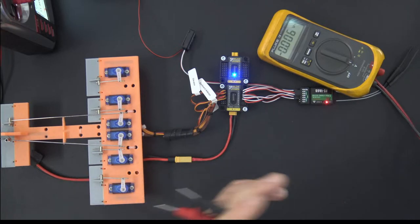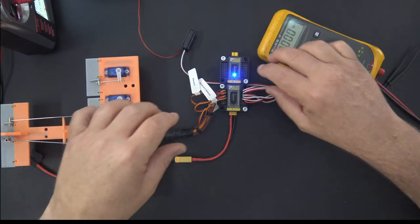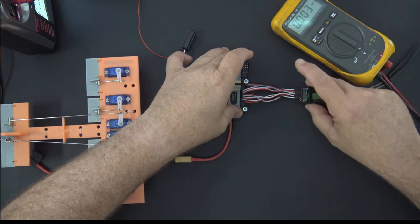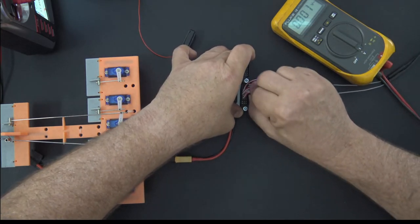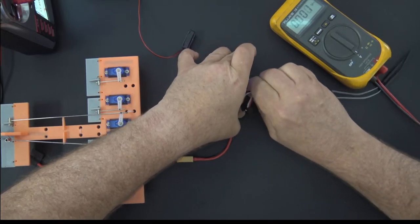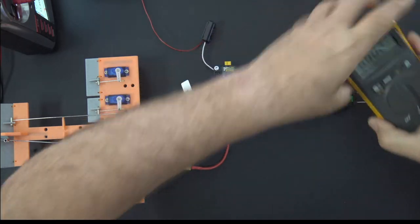23 grams. All right. So it looks like Mr. Skywriter says he'd like to see S-Bus. Okay, I can show you guys S-Bus. It's easy. So what I'm going to do on S-Bus, because that really kind of cleans this configuration up some, is not really, because we still have to go PWM from the S-Bus decoder, which in my case, I'm going to use the Hobby Eagle A3. In this particular instance, I'm going to use the Hobby Eagle A3 Super 2.